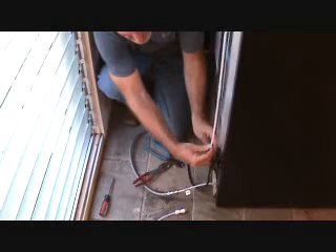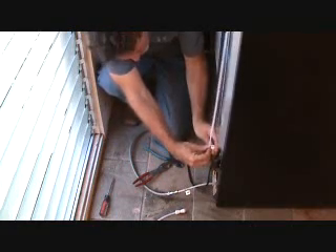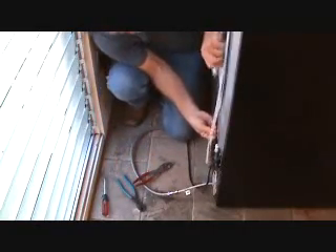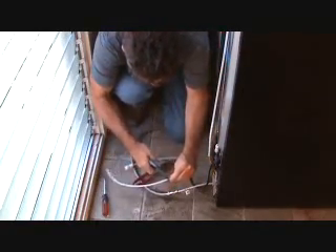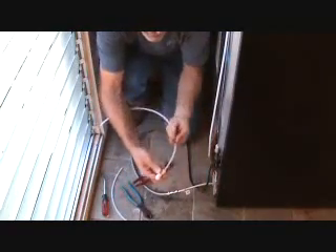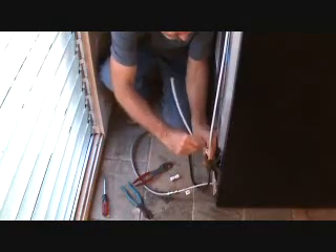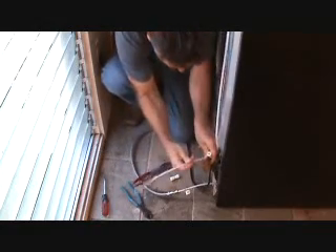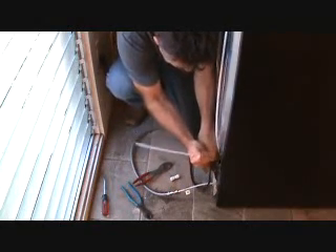Now, if I knew exactly where that leak was, I could have cut just a little piece out and put it back in there. I could almost do that, but I'm just afraid it might be up here. So I'm going to cut a little section of pipe and hold it up here to figure out about how high I want to go — just up about yay high. Now I can take this and push it in there. Make sure I'm in there tight. You can pull it back out, push it back in — looks like it's going in plenty. There it is, it's in.